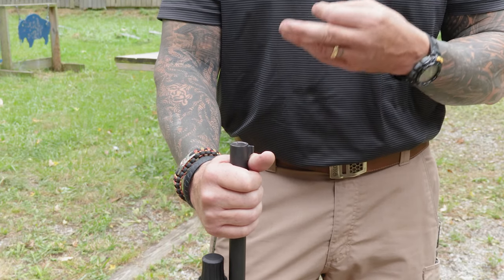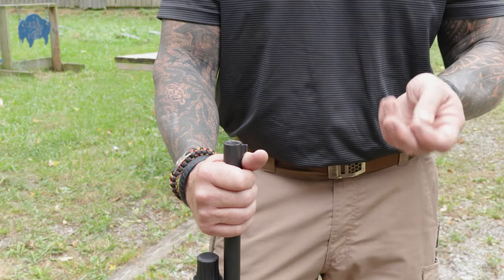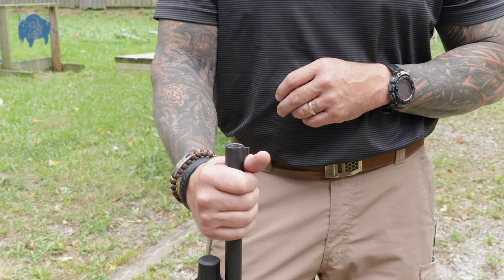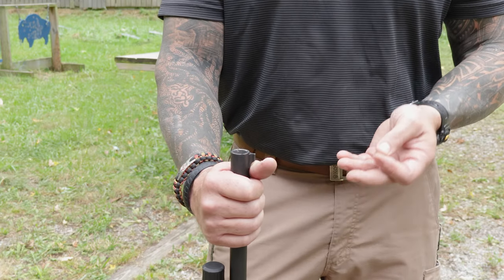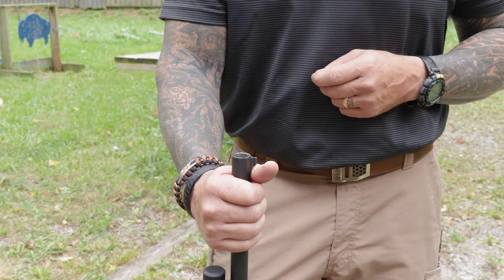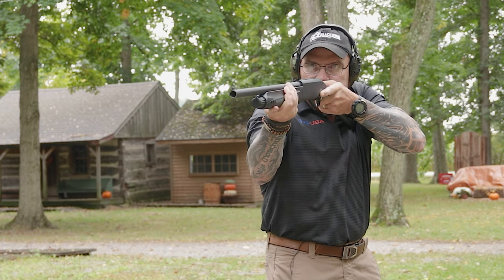If the dime doesn't pass freely, you run the risk of destroying the end of the barrel, potentially the choke, or shooting the choke out the end of the muzzle. This is something I would try and remove if at all possible. What I'm going to do is shoot the shotgun a couple of times and hopefully we're going to see the choke start to move out towards the end of the barrel — which in my humble opinion is not a good idea.